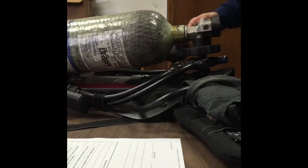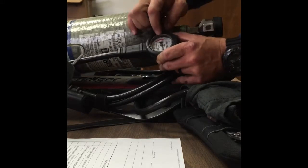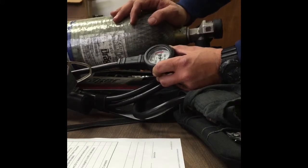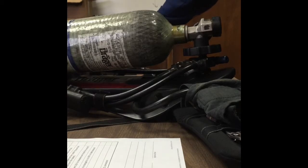At this point I can put my mask to the side. The next thing I'm going to check is my cylinder gauge and then my shoulder gauge and make sure that they're within 10% of each other or about 500 psi. I listen for my PASS to activate to go into standby mode.